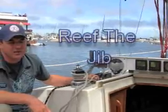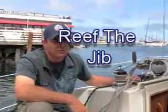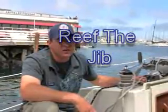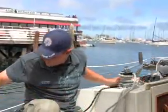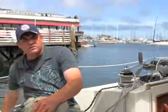After your first reef on the mainsail, you're probably going to want to furl 10 to 15 percent of the jib. Release the jib sheet — you can keep one loose turn around the winch for a little bit of control. Pull in on the furling line port side until you've reduced the amount of jib exposed. Close your rope clutch on the furling line and put tension on your jib sheet to fill the sail.